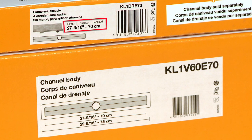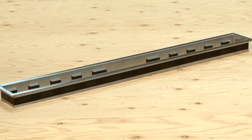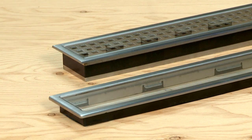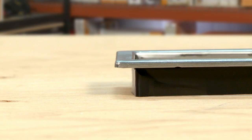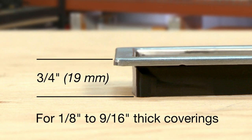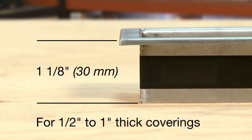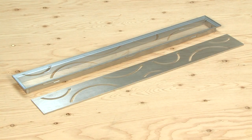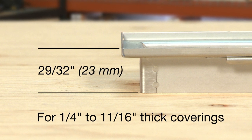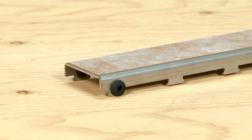You'll then choose the length of the grate to match the length of the channel body opening. Next, you'll need to choose the corresponding grate frame. Keep in mind that the grate frame options will vary depending on which grate design you have chosen. The frame for the closed or perforated grate option is available in two heights to accommodate different tile thicknesses. Select the three-quarter inch frame for one-eighth inch to nine-sixteenth inch thick coverings for standard ceramic and stone tiles. Select the one and one-eighth inch frame for one-half inch to one-inch thick coverings for thicker ceramic tiles and dimension stone. For the style grate designs, there is only one frame height available — twenty-nine thirty-seconds of an inch — able to accommodate covering thicknesses from one-quarter inch to eleven-sixteenths inch. For the tileable grate option, there is no grate frame needed and it can be used with any tile thickness.